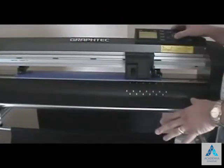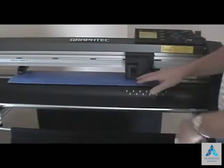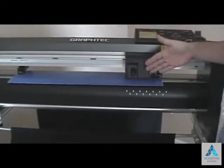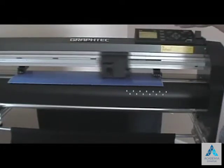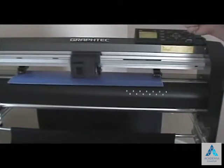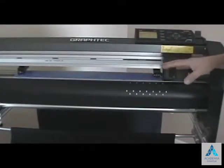Let's say we've finished our job, or there's some scrap in the front, or we just don't like the condition of the vinyl. We can set the new origin, but if we want a nice straight edge on our vinyl, there's a great feature called cross cut. Just click that button, the menu comes up — number one is cut, number two is cancel. Click number one and the cutter goes to the edge, initiates, comes to about the middle, cuts across, and that gives a nice straight cut on the edge of your vinyl. Very easy to use.